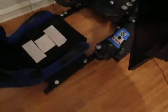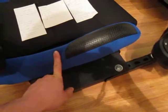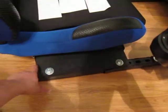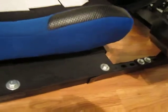The floor piece runs from the split to the back — it's two feet, 24 inches, same on the other side. I'm going to show you one side and you just double it for the other. The whole rig is two feet wide because the MDF board comes standard at two feet, so I just cut each piece for the width I needed. The MDF size which fits this chair exactly is fifteen and three quarter inches wide, and that's three quarter inch MDF.